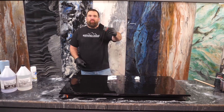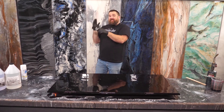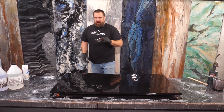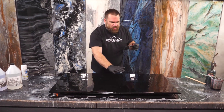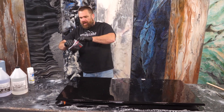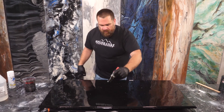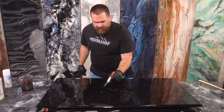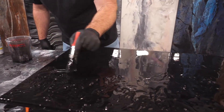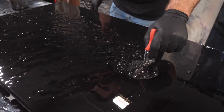We're gonna chop the top with our two-inch angled chop brush. First step, we wanna de-shed this just in case there are any loose bristles — nine times out of ten there aren't, but always check. We're gonna use the heel of that brush and eliminate the trowel lines by chopping the top. With the residual in your bucket, get your brush a little bit wet, then in a random pattern chop the top — this is mixing one more time and eliminating those trowel lines. That tiny amount of black dye made this like piano black. It's pretty cool.